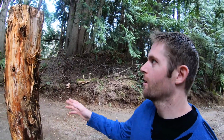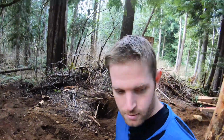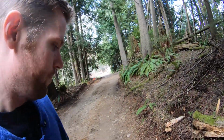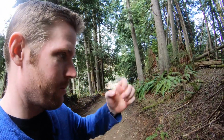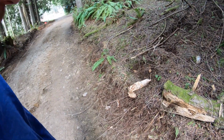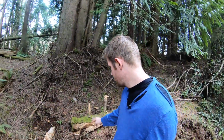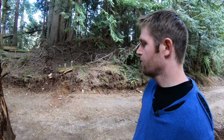Okay, I'll get the level back out and make sure everything's good. I'll push the dirt into this hole. I'll come over here. I'm just gonna kind of poke around with the bucket, see what happens. And the plan is to make like a little concrete footing here. I'm gonna set my 2 6x6 post bases in that cement. We'll see how far I get today.